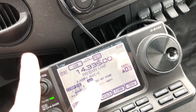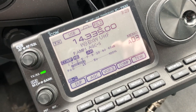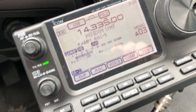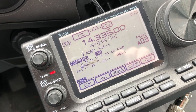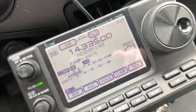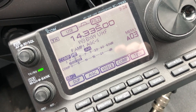Now checking power output with the HM219 — testing K2CJB. It looks about the same in terms of power output, not a huge difference. But the compressor is definitely getting hit with more audio, so there's probably a little more audio making it through. The main takeaway is that the compressor is definitely receiving a lot more audio with the new microphone.